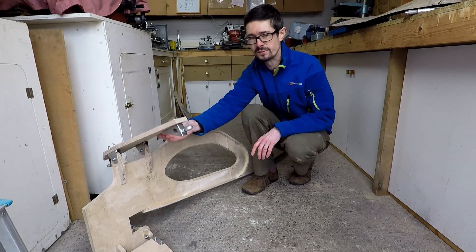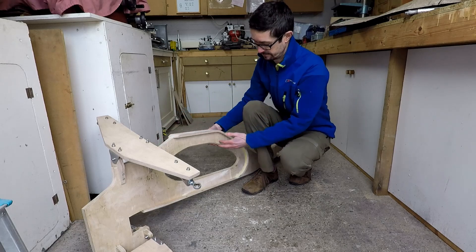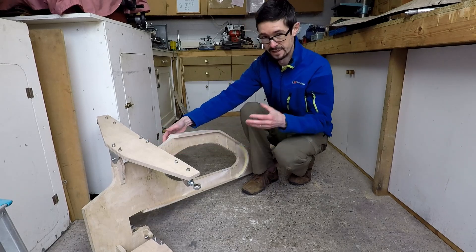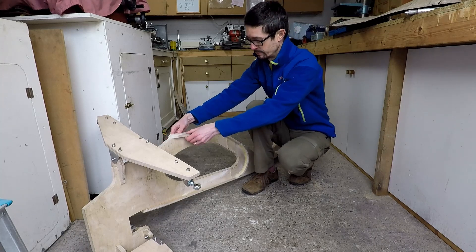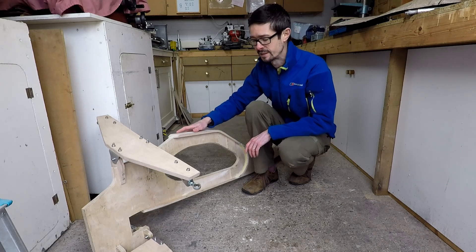The tilting arms are made of 15mm birch ply. The main frame — in the middle — is two layers of 15mm ply, so 30mm in total. We've got this stiffening strip down here which is two layers of 6mm ply.